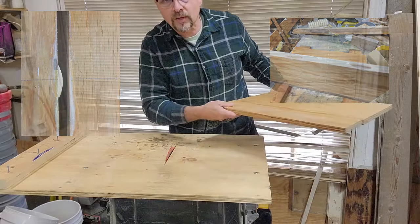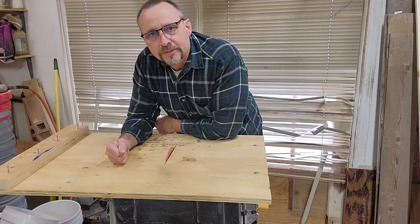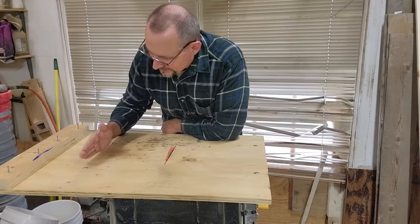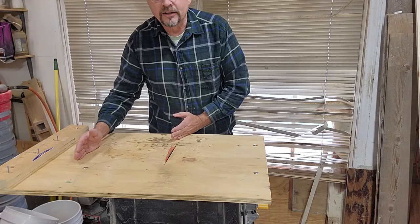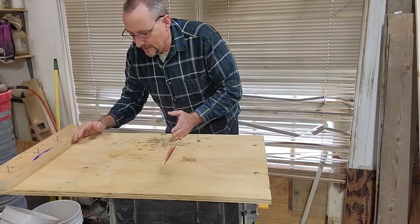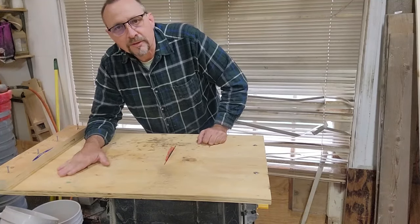Also, I have an incredibly cheap table saw, a Harbor Freight model. Shout out to Randy Dirt Rooster McCaffrey. He's got some hot sports opinions on Harbor Freight tools. On the Harbor Freight tool, it's got about a 12-inch right-hand clearance that you can mount the fence on. And obviously, in this build, I need roughly a 16¼-inch clearance. So I actually built this to make my Texas deep boxes, but I just moved the fence a little bit to make it work for this build.